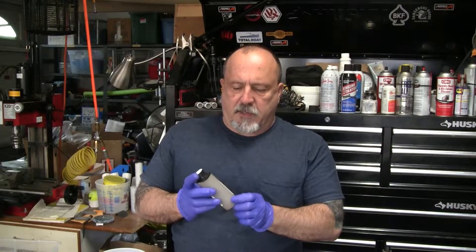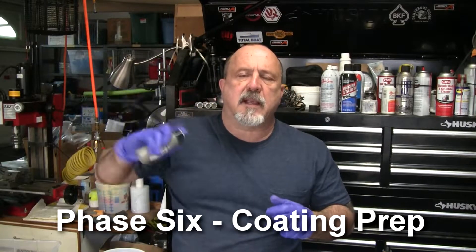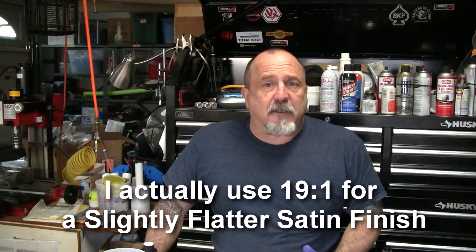The parts are in the spray cabinet cooling off. We're going to get ready to mix up some Cerakote. I've got a small container of the H-267 Magpul FDE, or Magpul Flat Dark Earth. Shake this for a minute — when you think you've shaken it enough, shake it a little bit more. There are a lot of suspended solid particles in Cerakote that are part of the coating process. There are a couple of different ratios: 24 to 1 gives a matte finish, 18 to 1 gives a satin finish, and 12 to 1 gives a semi-gloss. I prefer the satin finish.